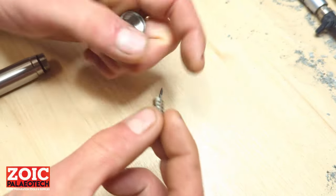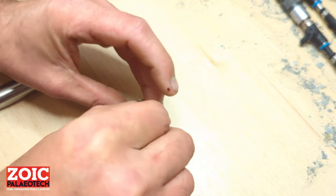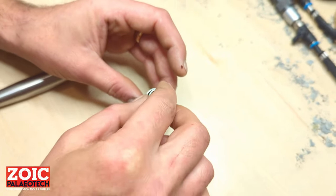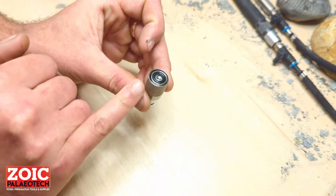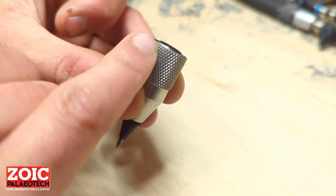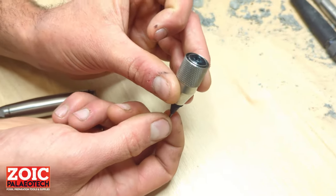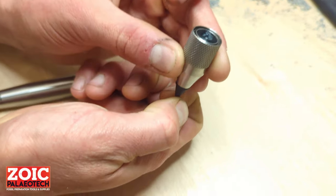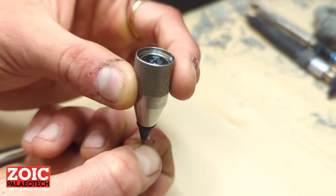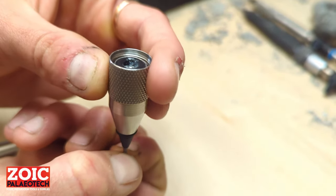The easiest way to do that is to put the spring right in, then drop the stylus in. If you notice that it is sitting flush to the level of the head or above it, it means that the two ears are not aligned. So just grab the chisel and gently twist until you feel them click — you can rotate the head or the stylus, but not through a continuous rotation.